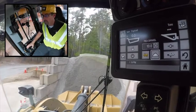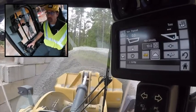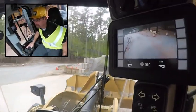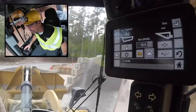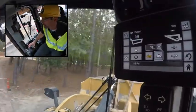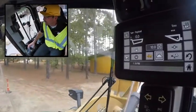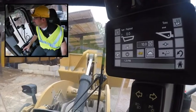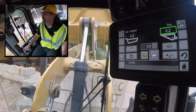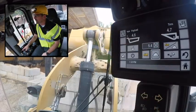Go ahead and get a load here. Now this first pass, I'm not too concerned about what it is, because I know I'm going to need at least two passes to complete this job. So I'm going to work as aggressively as possible — safely, but aggressively — get this material over to my target. On my approach, notice I'm carrying nice and low, but I'm going to start lifting up through the weight range and give a nice smooth steady lift. As I do that, I might get some estimated weights, but I will certainly get that green box weight after I pass through that precision weight range. In this case, it's showing 6.2.